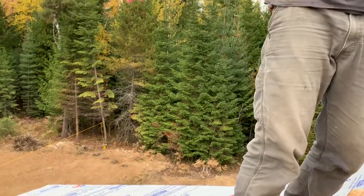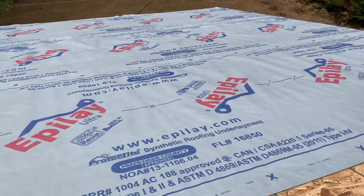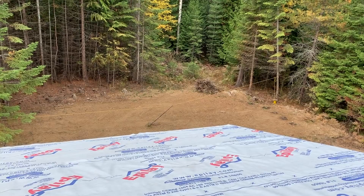We're making really good progress — it's lunchtime now. Check out what we got done: the dormer is almost completely done. We doubled up on the vapor barrier — ice and water shield at the bottom, then went over it again with the synthetic vapor barrier just to double it up. This is the lowest slope roof, so I'm thinking we may put some snow cleats on it so the snow won't slide off, but we'll see about that later.